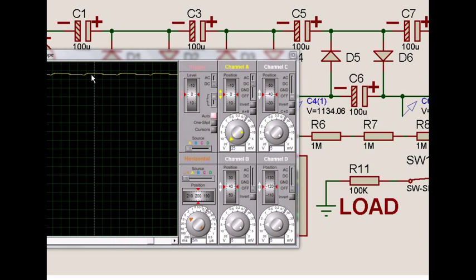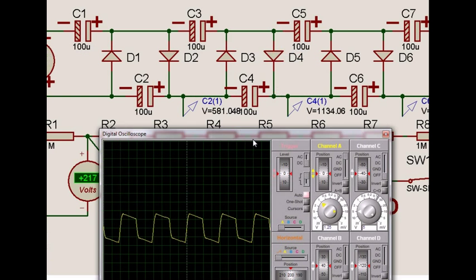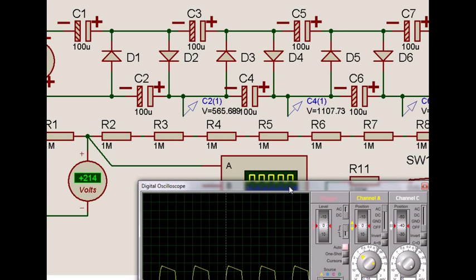To see the exact pulsating range, we can take the CRO to the AC scale. In the AC scale we are able to read the ripple. At the 1V scale, this will be the pulsating voltage over the DC that we had seen. This behavior is very common as far as any loaded voltage multiplier situation is concerned.